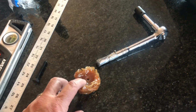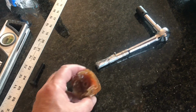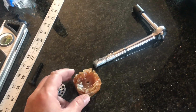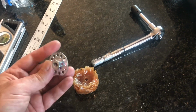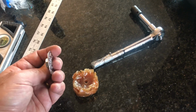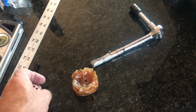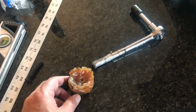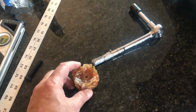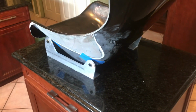I'll use a tap, and then I actually torqued a bolt to 22 foot-pounds, and this thing held beautifully. So the idea is I'll have this facing the outside so that it presses up against about a 1/4 inch worth of fiberglass, and it should provide enough strength and not loosen up. Okay, but anyway, that's sort of the game plan. We're coming to the home stretch here.